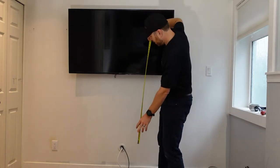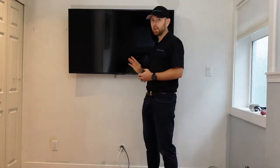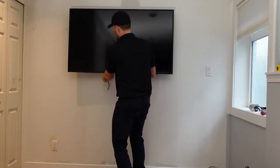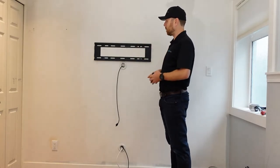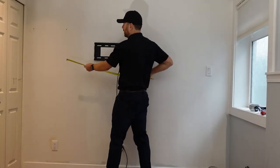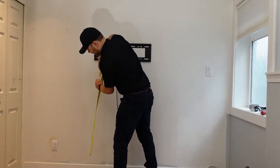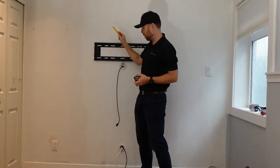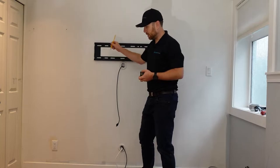It's 47 inches from the floor — that's where the outlet is going to go. I'm going to take the TV off — this one just has little hole straps — unclip the TV and put it to the side. With the TV off you should see the bracket. The TV is 24 inches or two feet from this wall, so I'm going to mark it at 26 inches as a couple-inch buffer, and 47 inches is where the bottom of the TV is, so I'll mark about 50 inches. I want to build it as close to that outlet as possible because there will be studs in the way.